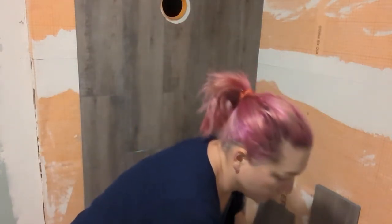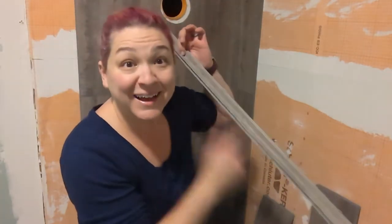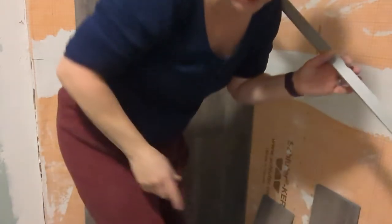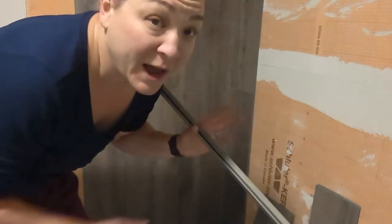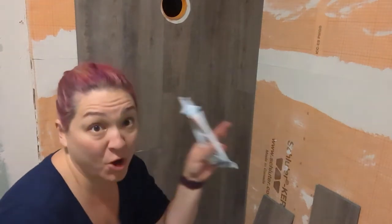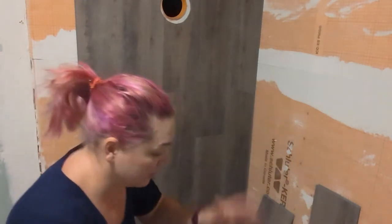We used corner trim, which looks like this. You cut it to the height you need and stick it in place. That's the first thing we did because this is a one-corner installation and we are working out from both sides. If you are doing a whole tub, you're going to do it a little differently — probably go watch my other video because you have to fit between the two corners. I attached this corner piece first. I added my silicone caulk into the gap and then started with my pieces while the caulk was still wet, because you want it all to dry together.